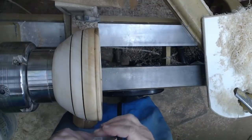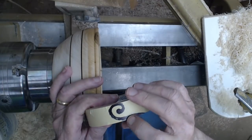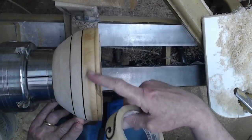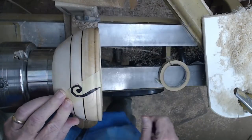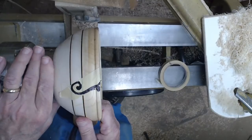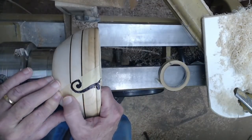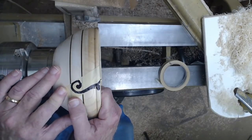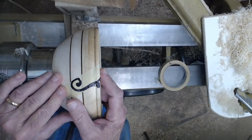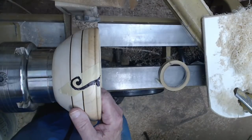While it's still on the lathe is when we're going to do our cutting. The tricky part — this is where you're paying the big bucks — is designing the J-hook so the yarn goes in the dark area and doesn't touch anything rough. You want to do it on side grain, not end grain. I've watched a lot of videos, and there's an issue in the October 2014 American Woodturner where someone made a jig to cut this with a router. Others have used Dremel accessory tools. Kenneth Gunnell suggested getting a special coping foot for a saber saw, but for me what's going to work best is just a coping saw.